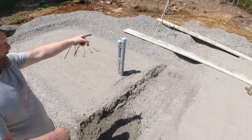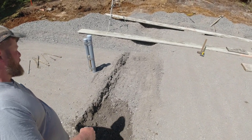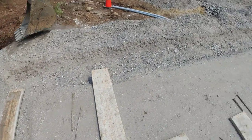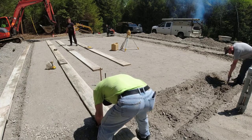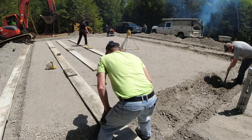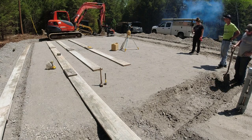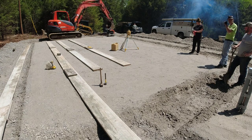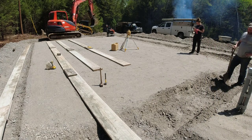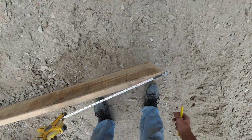This little 12 by 14 side room you see over there on the left - that was another thing I wasn't prepared for today. I didn't know it was all ready to go; we were just told to come form the house up so the plumber could get here. I didn't even bring enough forms to do that. We ended up just getting the house formed and came back a couple days later and formed up the little 12 by 14 utility room. The utility area really didn't have any other plumbing in it other than those two pipes you see right there, so it wasn't as big a deal. Right now we're waiting as the excavator digs that haunch a little bit wider so we can get our forms in.